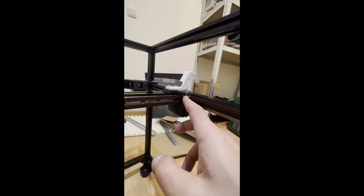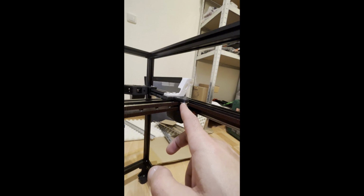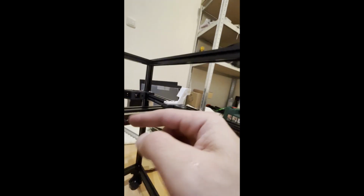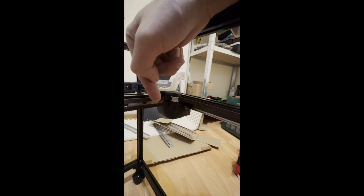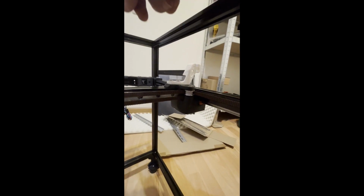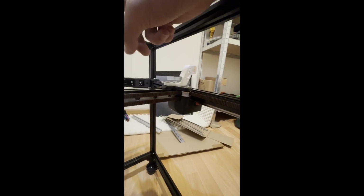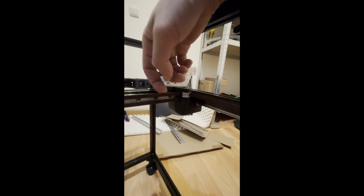A pulley has teeth. So for example, for the top one, since it's turning with the pulley, the teeth side is matching with the teeth, so it's not going back. It's not using the flat part but the tooth part. Since there's a bearing, it should use the back, flat part of the belt. That means it should go to the back. If your next turn is a pulley, it should turn on the tooth face. If the next is a bearing stack, it should turn on the flat side.